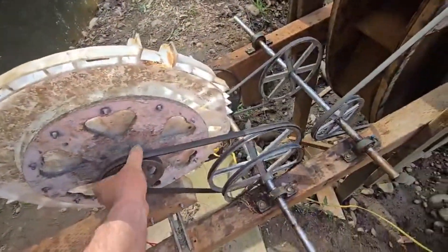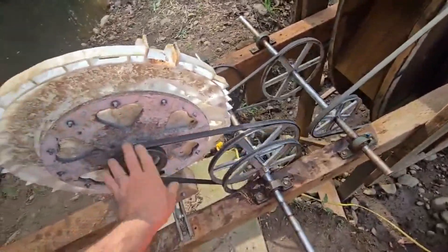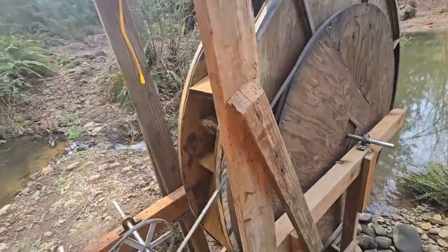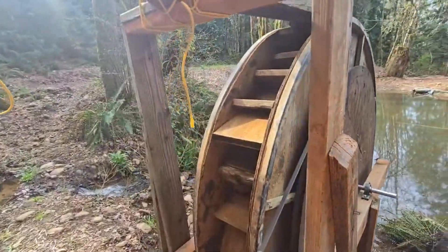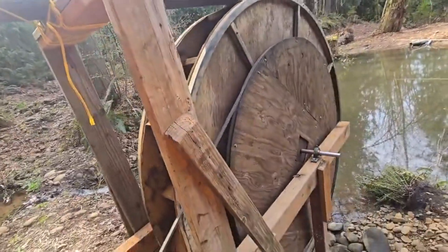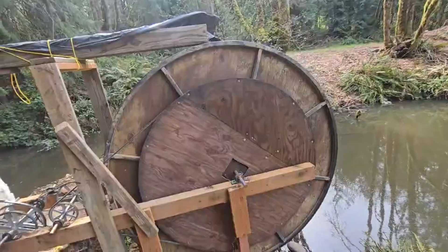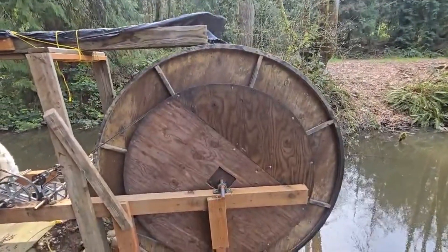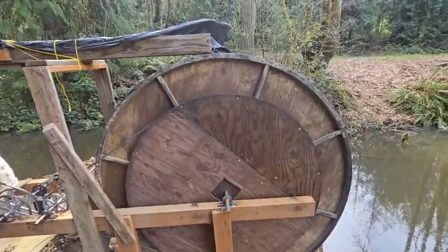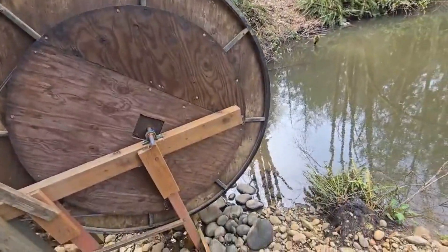You can see how easy this is to turn. This gets us about 300 RPMs, but the wheel is barely turning at that. So if I had more buckets to create more water capture that would help. Also on the flume, you want the water to land at about halfway up — right above the spindle is where you want the water to land, start filling buckets up, and then it'll carry out and dump down here.